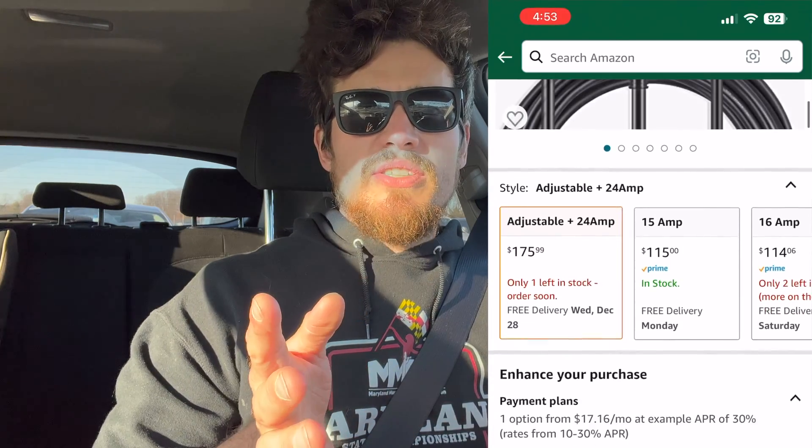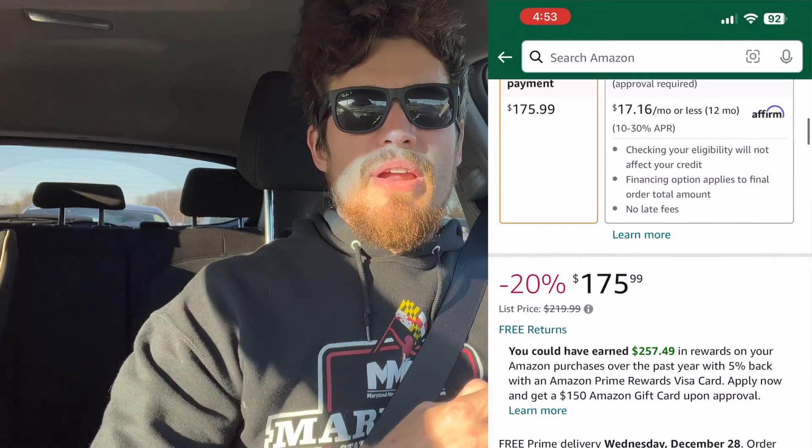After another video where I was talking about chargers, I thought I'd get one to test out. I was trying to find one that was a little economical but safe and had a decent charge rate, so I landed upon this one. It's a NEMA 10-30 by VIVOR and only works with a traditional dryer outlet. I figured most people who buy an EV and don't have anything wired to their house yet might have a dryer outlet. It might be expensive to run a line, but not as expensive as having electrical work done, expanding your panel, or having a level 2 charger installed.